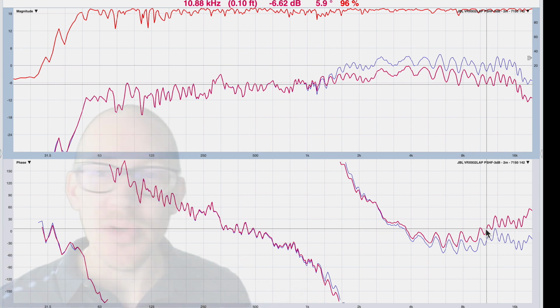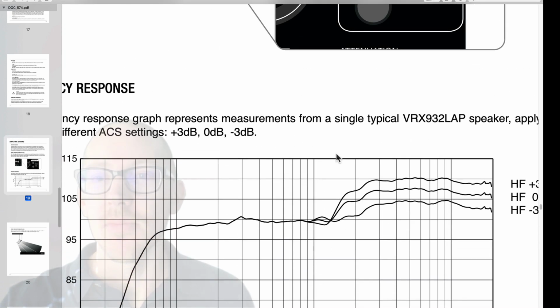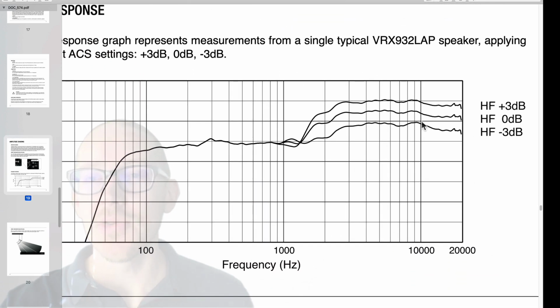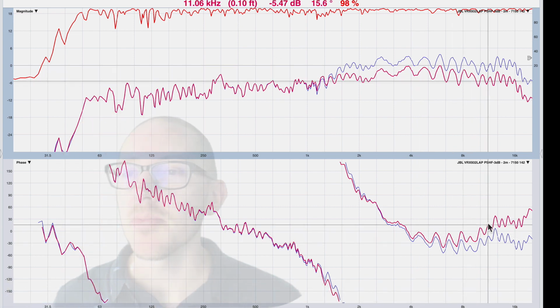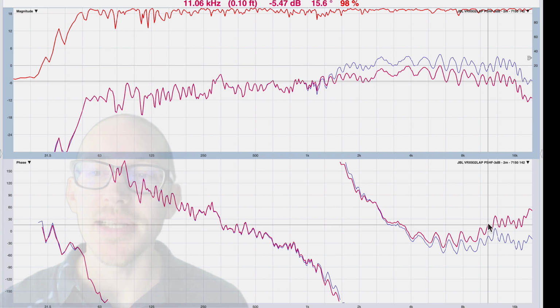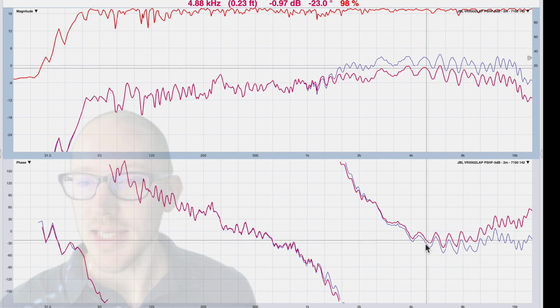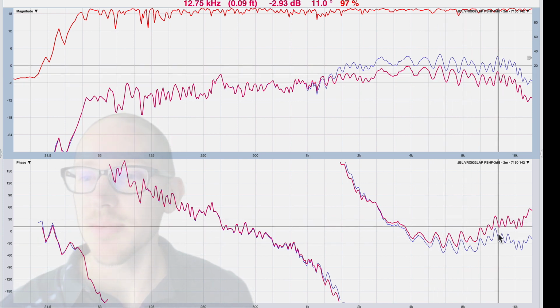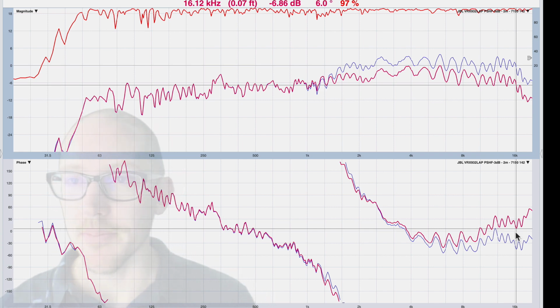The next thing I noticed is that the phase shift is so small, which if I knew more about filters, I would have known already, because even just looking at this graph, you can look at the EQ change and know what the phase shift is going to be just from the properties of minimum phase. But I don't know anything about that, so I assumed it was going to be like 90, 100, 180 degrees, and that's why we should be afraid of it and it causes these problems. But if we look here, it's like 10, 20, 30, and only gets up to 60 degrees here in the very high end, around 16, 18K.